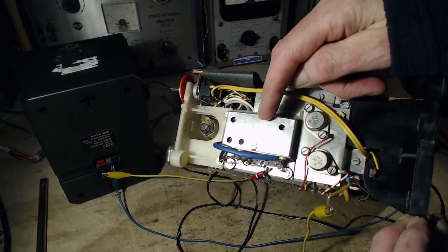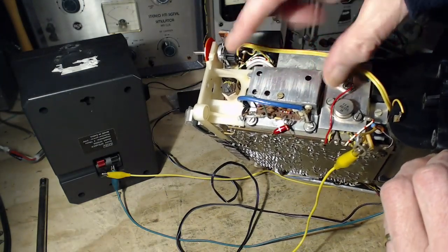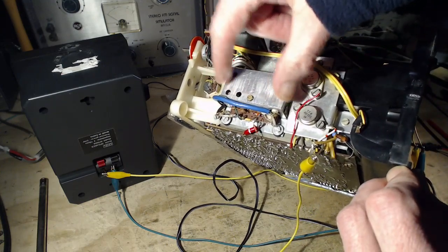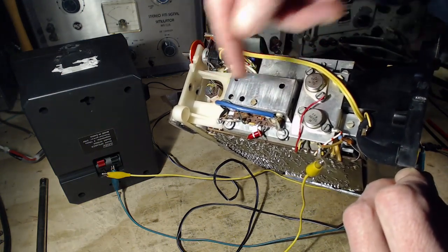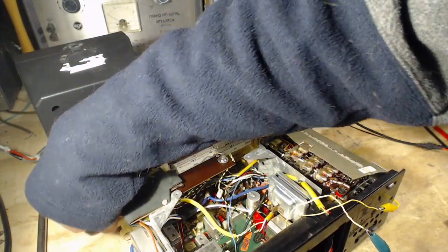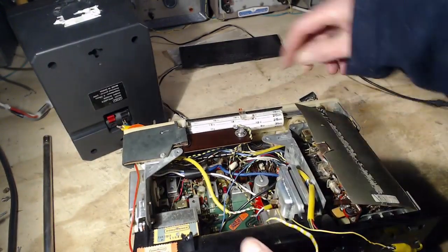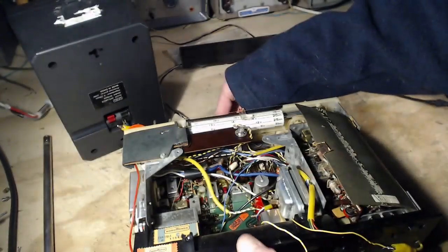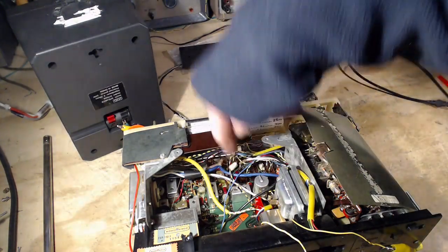This is likely to be the RF part of the radio. So it's operating up at 100 megahertz inside this can. And then out of here, probably the conversion takes place in here, and then out of it, maybe on this blue cable here, comes the output, the converted output at 10 megacycles. So guessing the blue wire is the wire, it's just a wild guess here. It comes along, disappears down in there, goes on to this button here. This button is called the FM button. So blue wire goes to the FM push button.